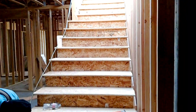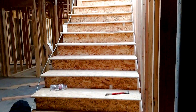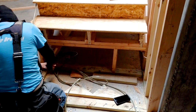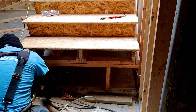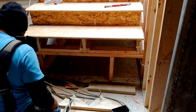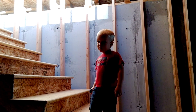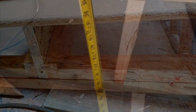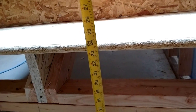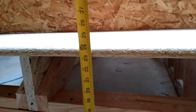What happened was they finished building the staircase and we found out the last step ended up being three inches taller than all the rest. So we tore out the last couple of steps. Fortunately it was built into this little wall, so what we're doing is cutting this wall down by three inches, dropping the staircase onto the new shorter wall, and then shimming up all the stair treads to make them level again. Each of these steps was supposed to be right around 7 inches, but 24 inches is not divisible by 7 inches — there's a remainder of 3 inches, which caused the problem.